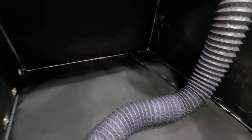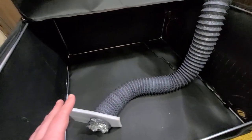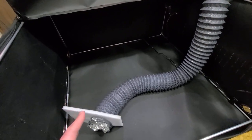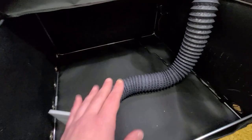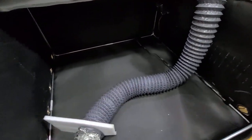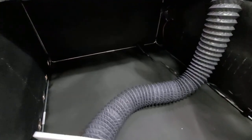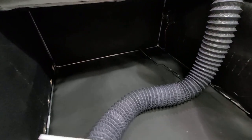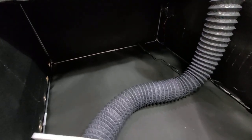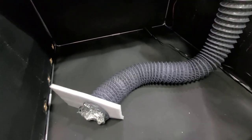That moves a whole heck of a lot more air. It works okay. But that's the worst part about this whole fume hood or fume enclosure: it just came with a fan that basically does not do anything. Upgrading the fan to a noisy server fan is loud. Not as loud as a 30 watt that I had tried earlier, but that thing was like a jet engine. But with the 15 watt fan, there's enough airflow that I do not smell the fumes when this thing is running, and I have some pieces of cardboard and I pipe it to the window.